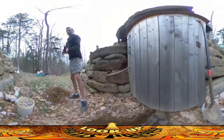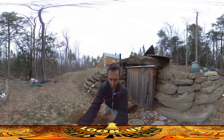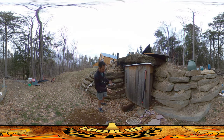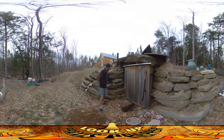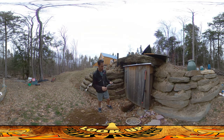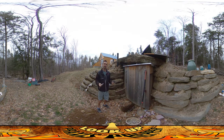Now the next step for me is to start putting things back. There's a bunch of gap around what I think is a three-inch drain pipe, so what I figured I'd do is take these excess pieces of tile — tile I'd used all around the bathroom — these are the scrap pieces. I always keep this kind of stuff. This will act as a great way of sealing up around that three-inch vent pipe so when I put gravel in, the gravel is not going to pour down into the structure. I was thinking, oh man, I wish I had some thin pieces of stone that could act as a block down there — and here they are. I love keeping scrap so you can use it for stuff like that.